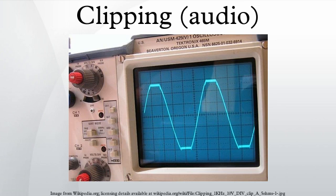Intentional limiting circuits would not be expected to come into effect in normal operation, but when the output load resistance is too low or the system is connected to an exceptionally high signal level, for example. The result of this form of clipping might not create a flat top to the voltage waveform, but rather a flat top to the current waveform. Certain signal processing elements can produce a unique form of phase-inverted clipping when the input signal exceeds the common mode input range of an op-amp. The result is that the voltage waveform clips, but in the wrong direction.